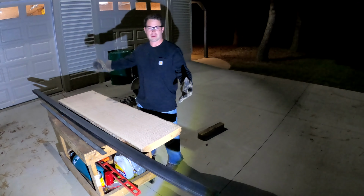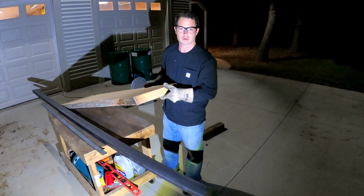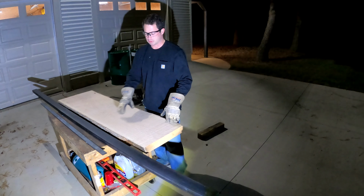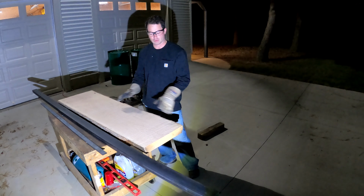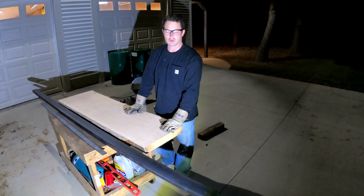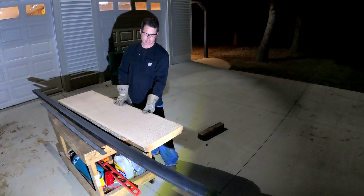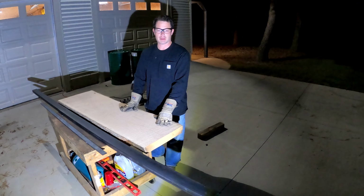This is a 5 foot long slab. It's about 2 inches thick, maybe a little bit thicker. This is red oak, and then it's about 18 inches wide, and it's a live edge, meaning that it still has the bark on it. And for this, I'm going to keep it very rustic, so I'm not going to do a lot of finishing to it. I'll take a sander to it and clean up the top surface so you don't get splinters. But it's popular often to do a scraping where you scrape off much of the bark. I'm going to leave the bark on there, and then I'll polyurethane it at the end.